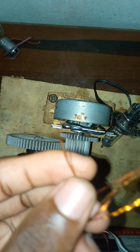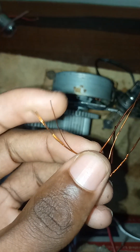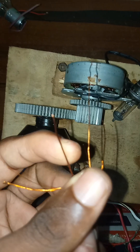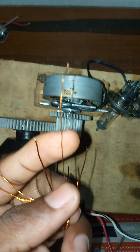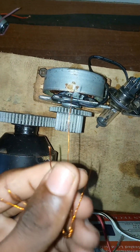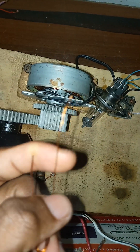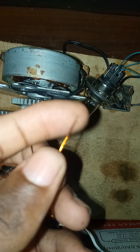I'll be using this size of coil to create the high voltage. This is the size of the coil that's inside here. I need to get 24 volts or more, while this other larger size can give up to 48 volts and more. This smaller coil can handle more than 12 amps, and the larger one can handle 6 to 10 amps — I haven't used that coil before. This is the same coil I used in this generator.